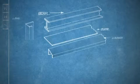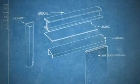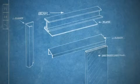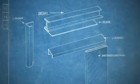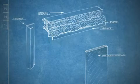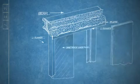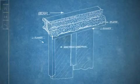If the wall is offset — meaning not directly under the beam — this detail shows the method for achieving a rated head of wall when using a steel plate. The plate is attached to the bottom flange of the wide flange beam prior to spraying fireproofing so that it extends out and becomes the head of wall. This prevents any break in the separation between spaces. Attach your J-runner to the plate, then apply spray fireproofing, and follow the sequence outlined previously to complete the shaft wall.